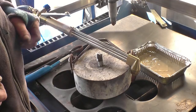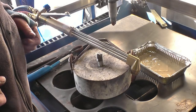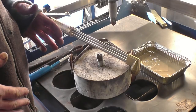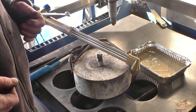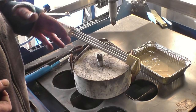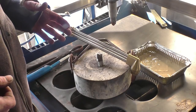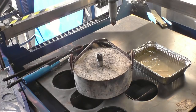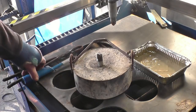To harden off this tap, you heat it up to a cherry red heat and quench it in cool water. That makes it really hard — what they call glass hard, virtually brittle — and then we'll temper it back to a straw colour, which is ideal for metal cutting. Let's get some warmth into it.